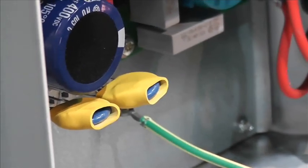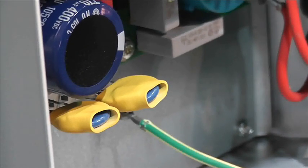Those yellow things down there are the thermistors. What happens is if the DC voltage is too high, those thermistors heat up, their resistance changes, and then it switches everything off. But we shouldn't be getting anywhere near over-voltage anyway, because rule two of solar panels is: never go anywhere near the maximum values of current and voltage.